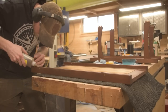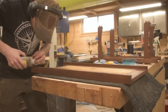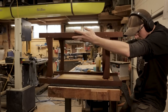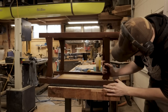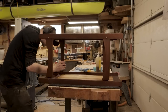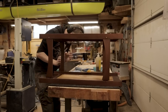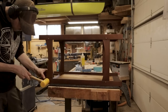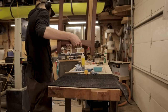The last important thing to mention here is that I'm doing my glue ups in a very intentional way. The part that is always holding the glue is always oriented downwards, so I don't have to worry about the hide glue flowing out of the mortise and dripping onto other pieces. This is a problem I've caused so many times in the past — if you have a piece with all the tenons sticking upwards and you drop the other piece on top, that's really a bad way to work with a liquidy glue like hide glue. Doing it this way lets you fully avoid that glue dripping all over the place. No clamps and we're fully glued up.